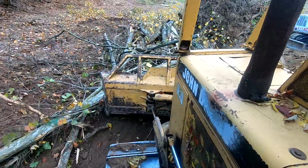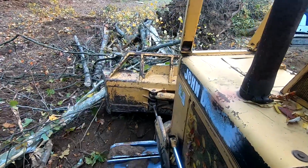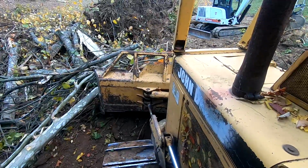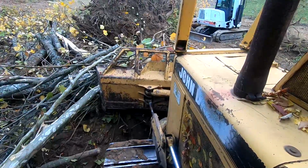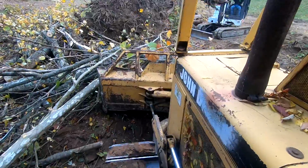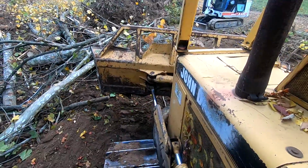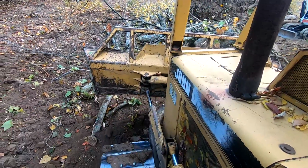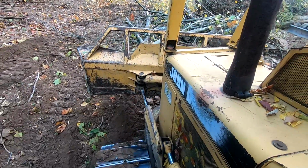And you have a bunch of busted up timber that you end up with. But by having this position where it's at, we're not transferring this material very far. You can see it's not moving very far. You're right where it needs to be, and it's out of the way. And then whenever we need to push the next tree down, the excavator doesn't have to go very far to be out of the way. So he's not wasting lots and lots of time tramming in and out of the danger zone to go find safe ground.